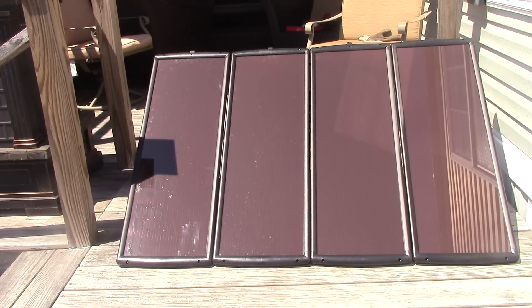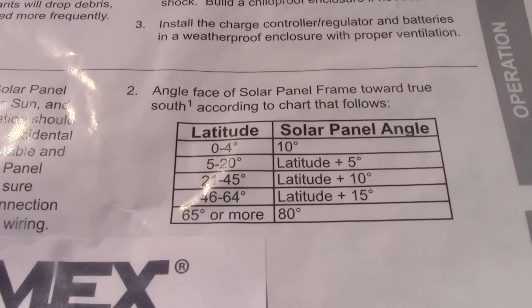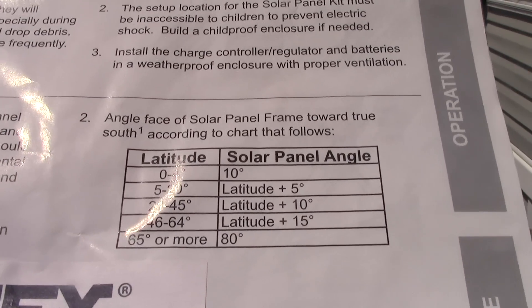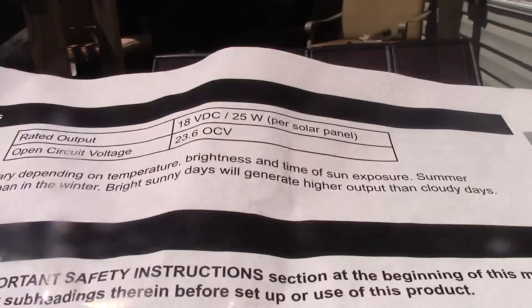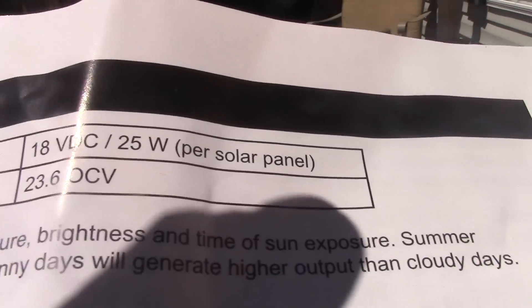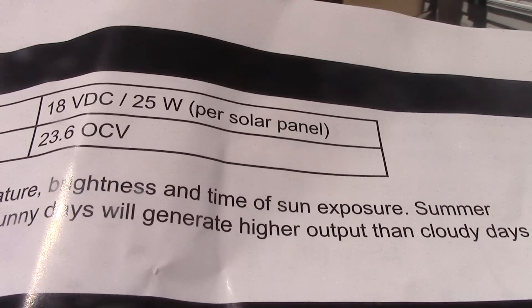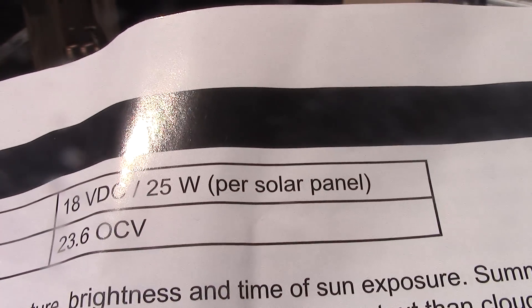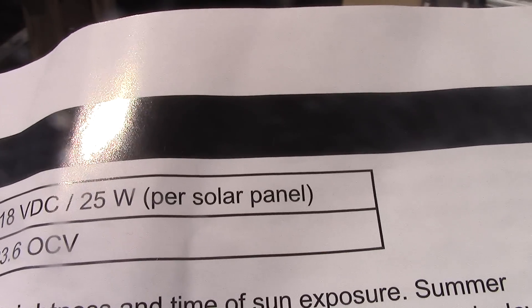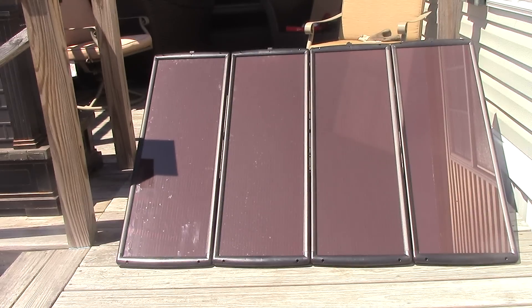One of the things I like about it is it comes with a guide for your latitude. If you're new at setting solar up, you can see that latitude chart for your location in the country. The next thing was your open circuit and rated voltages. What I found was it was on the plus side between 24.5 and 25.25 on your open circuit voltage, which is awesome — they specced out higher than their ratings, towards the plus 5%, which was excellent.